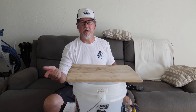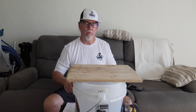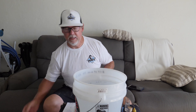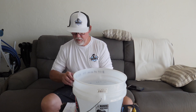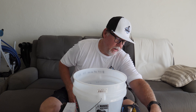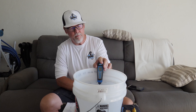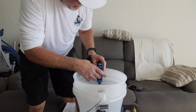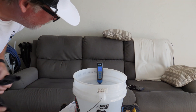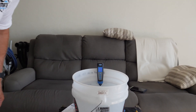That's what you're going to put into a 15,000 gallon pool — if you pour in a full gallon of chlorine, you're going to get about 8.8 ppm chlorine. As you can see, that one point — I wouldn't even worry about it because like I said in the other video, the chlorine went down anyway. So we're not going to worry about that. Let's put the pH meter back in — we got about 7.9.